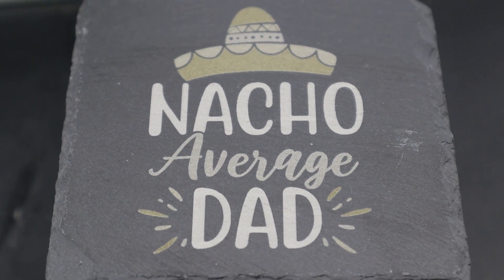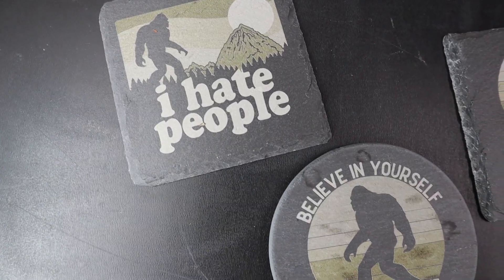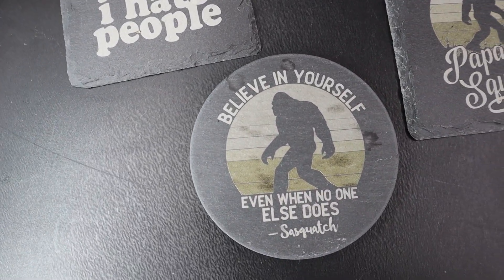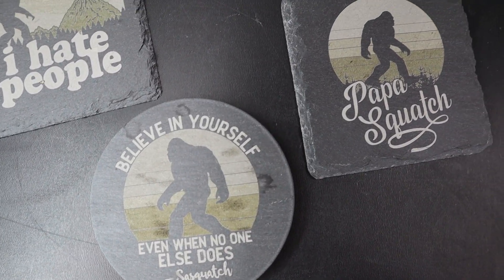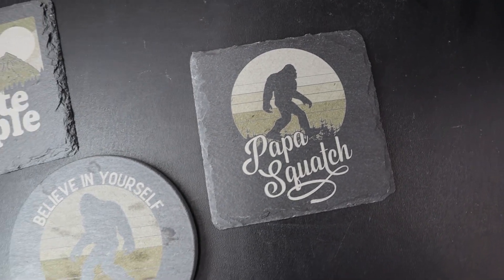Really, it's one of the sharpest quality engraving jobs you can get without going super big budget with fiber or UV lasers. And as you saw, this is not very difficult to do. I've basically shown you how something that at first you'd think requires a really expensive laser is not true. This shows you the benefit and reason you do engraving speed and power tests on materials — without doing that, I would not have been able to see that I had a wide range from gold to tan to gray to even near-white with that infrared laser, had I never done the engraving test to begin with.